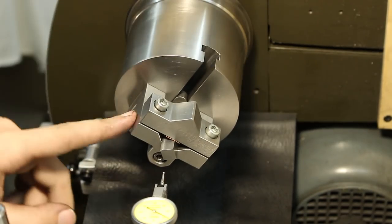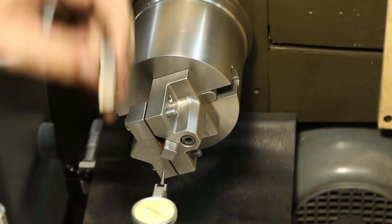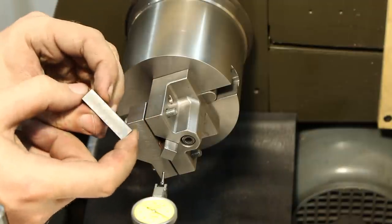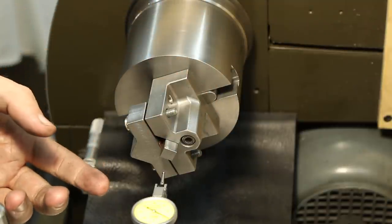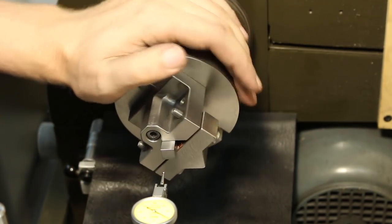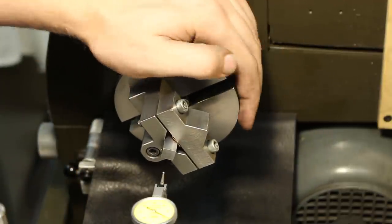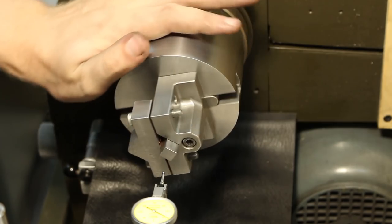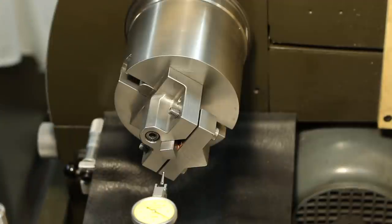Okay, I put the V-block chuck on the lathe and I centered the pieces of material that I prepared earlier. They were machined square to size and to length, and we need a round spigot on the end where the 10mm bearing ball will get glued onto. So I took my trusty V-block chuck, only one in the world I think, put it on the lathe, centered the part, and now we can turn down the square cross section to a 4mm round spigot.